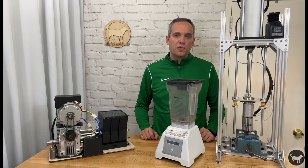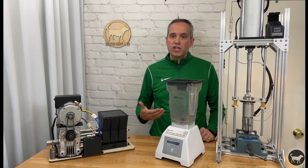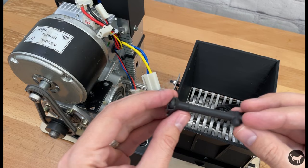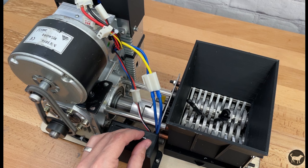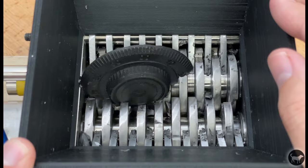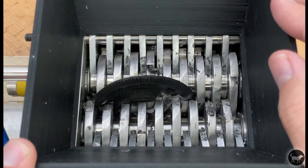The next thing I wanted to do with this machine was to break down some polypropylene that was left over from the injection molding machine. This can be runners or sprue material or even failed or unwanted parts. These can be quite a bit thicker than the milk bottle, but with a little work and patience it worked just fine — even fairly thick pieces got gobbled up. I'm only using a 24 volt 300 watt motor, but you could use a 24 volt 500 watt motor or a 36 volt 800 watt motor or even higher, and that extra power can make for even quicker work.